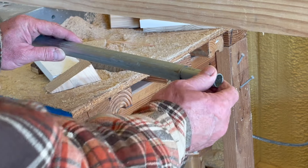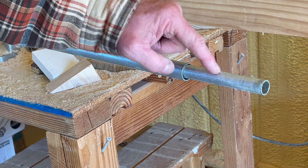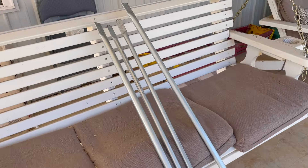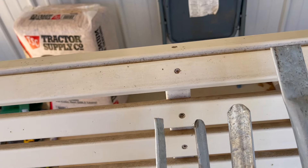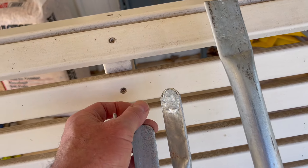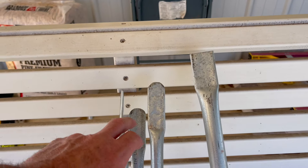In yesterday's video, I showed you this right here. My EMT conduit was 10 foot long, two pieces — a half-inch piece and a three-quarter-inch piece — so they can slide in and out of each other. I cut it into four pieces, so I've got four five-foot pieces here, and then I shaped one end of each piece. This is just flattened out. It just goes in a vise, and then on the half-inch piece I actually rounded the ends like this. It's not sharp at all now because I've filed it down. This is exactly what I want. I will put a quarter-inch hole in each piece.